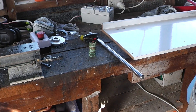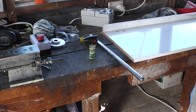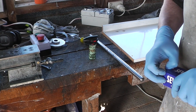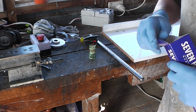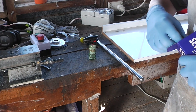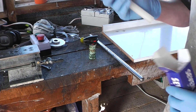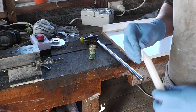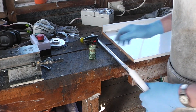Hello, welcome to Have A Go, I'm Alan. Today we're going to see if we can make a start on casting the faceplate. We'll be casting on a mandrel again, and with all the trouble I have with mandrel sticking, I'm going to try what Gingery actually advises to do and see if I can put some soot around it before I put it in.